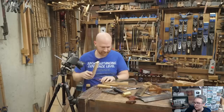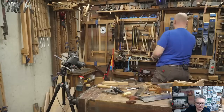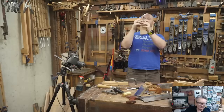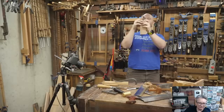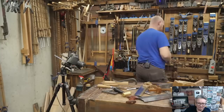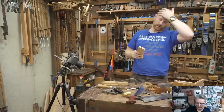What's the angle of the tails? It looks like a one to eight. The angle is around a one to six, maybe one to five. Let me get my little jiggy thing out — yeah, about one to six. This tail is almost dead on one to five, whereas this tail is a little off, maybe one to five-and-a-half to one to six. I don't get picky with them. Usually the shorter the tails are, the more I want them to splay out and have a bigger angle; if they're longer I'll put up with a shorter angle. If I really want to show them off I'll have a big splayed angle; if not, I can keep them more narrow.